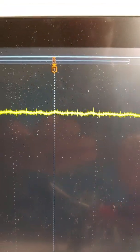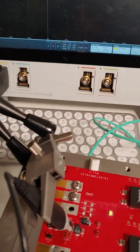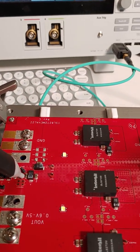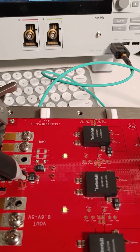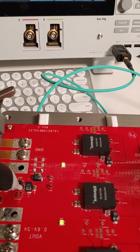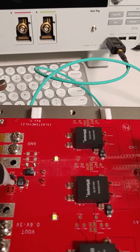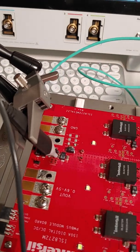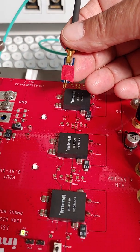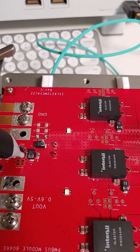How fast is it? The actual speed of the probe itself we measured at about 500 picoseconds. Of course, the actual interconnect will depend on how good we can make the inductance between the high-speed load and the board. But ultimately we are aiming to get a solution that's scalable from 2 amps to 2,000 amps, and they'll all be sub-nanosecond — in different incarnations from socket adapters for 100-millimeter devices, browser probes, and even replacements for 1206 decoupling caps.